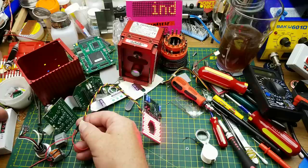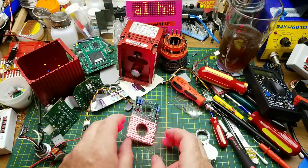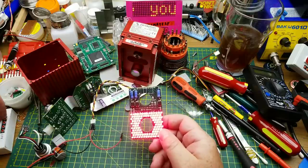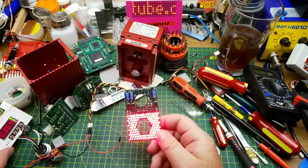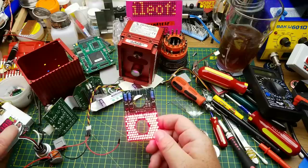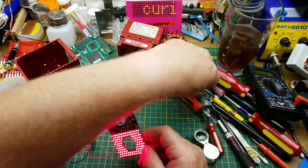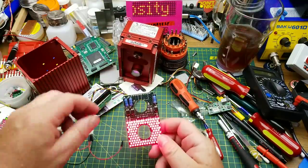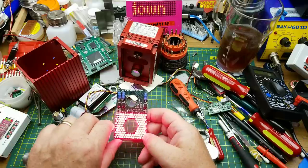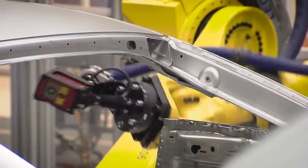I've connected five or 12 volts and ground to it. This yellow wire is the control wire — if I ground the control wire the LEDs are off, and if I lift it, being a MOSFET that makes sense, we have this bright little array of LEDs drawing towards 365 milliamps at 12 volts. It would have been regulated 12 volts coming from that power supply over there. Those resistors and LEDs are getting somewhat toasty, but it probably wouldn't have to be on for very long — just to act as a flash for that camera.